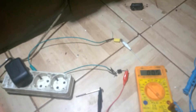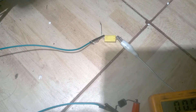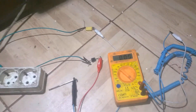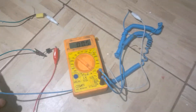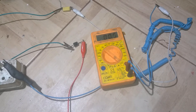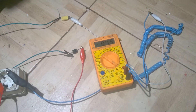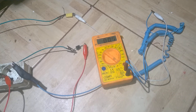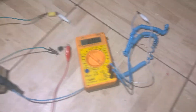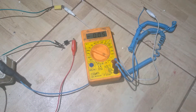Now let's remove that one and put in a good one. We have here a yellow Philips capacitor from a Philips set. I know it's rated at 250 volts but I don't know the value because the markings got erased. It's probably fine — these capacitors almost never leak. So let's test. Watch the meter: it jumped to 27 volts and then went right down to zero — 0.05 — which is basically zero.